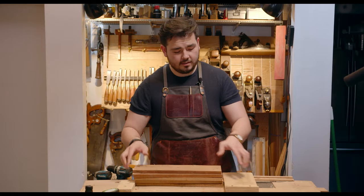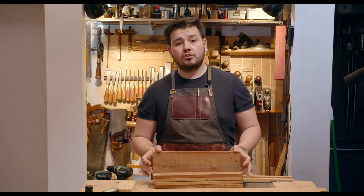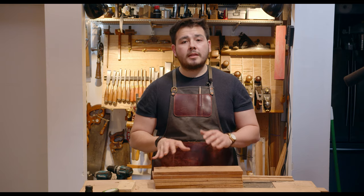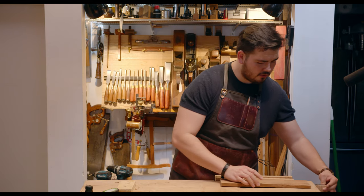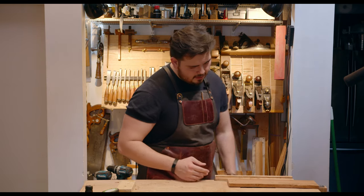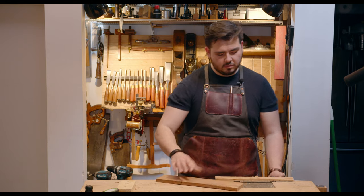Now I've got a stack of boards cut and ready to be surfaced. There are gonna be two things we focus on: first, getting the edges jointed so they all line up nicely, and at the same time I'm going to address the faces of the boards while they're small — there's gonna be less overall twist and warp in them. For planing small boards like this, a planing stop is good. I've got one right here at the end of my bench with a little twist-lock mount — a nice way to handle small boards.